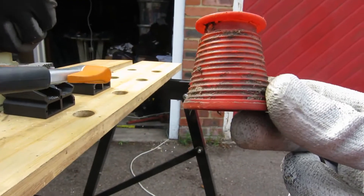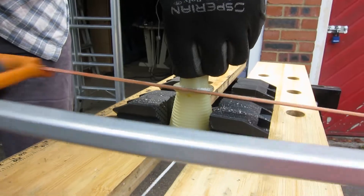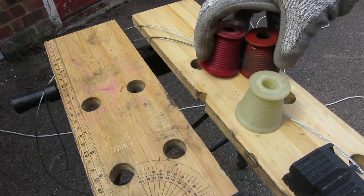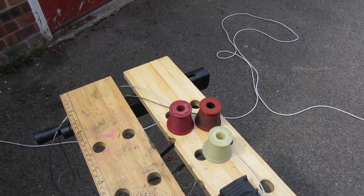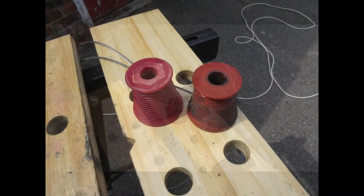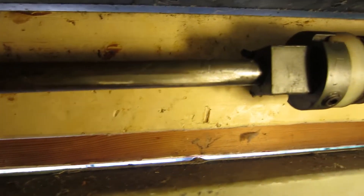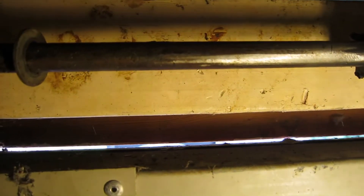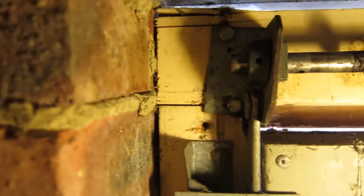The cones don't need a nut on to remove the nut. After some sawing and filing, the top nuts have been removed on this version so they now match, and we're ready to put those back on — which was left and which was right probably matters. The shaft has been cleaned, ready for tightening the spring, with a little bit of flat filed onto it at the opposite faces of the grub screws.